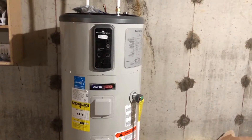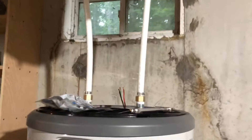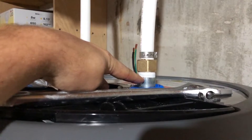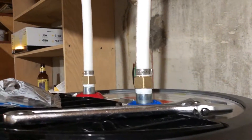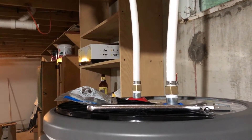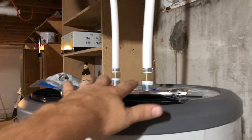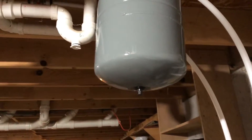We're back and we've got most of our plumbing done. Here's what we've got going on - again, this is the cold water side. This is a three-quarter inch fitting coming out of the top - pretty standard. I use PEX; if you're unfamiliar with it, you can just research it. PEX is this piping - it's very easy to work with, a lot easier than dealing with copper. No soldering required; you just clamp them down. Following our cold water line, I connected here using a PEX connector. I ran a three-quarter inch water line because that's what the unit called for.